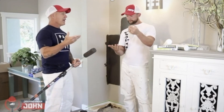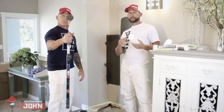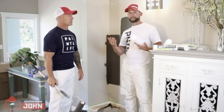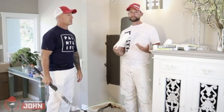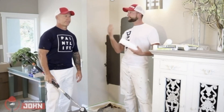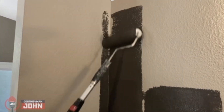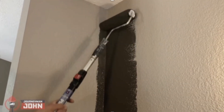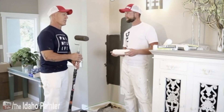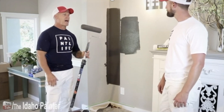Nothing comes out of it. So what does it really do, John? It's not just a typical roller. It's not just a typical 9-inch roller. You might think it's a little silly, but they rounded it over on the edge on a full 9-inch roller. This is made so that you can actually just roll your ceiling cut-ins, and that's where we use it a lot. When we're rolling ceilings, we'll have one of the guys bust out a 9-inch roller. They'll bring that ceiling color all the way down to the wall, or if we're doing the corners on walls — it just works. It works amazing. It's like a regular roller. This is one roller that will complete several different tasks.